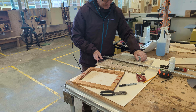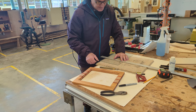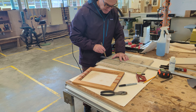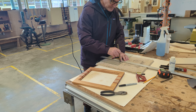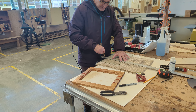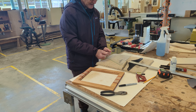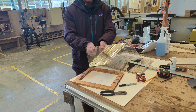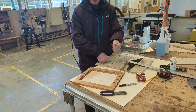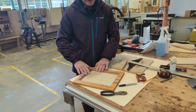This is kind of a long square. I'm on my two marks. Yeah, that glass is pretty square. I'm just very gently going to push down this way just to get a little oil on it. I'm going to start here and go all the way off. I put my two thumbs on top just like this and then I break it up, supporting with my thumbs, and it should break right off and then it should fit right in there and you're good to go.